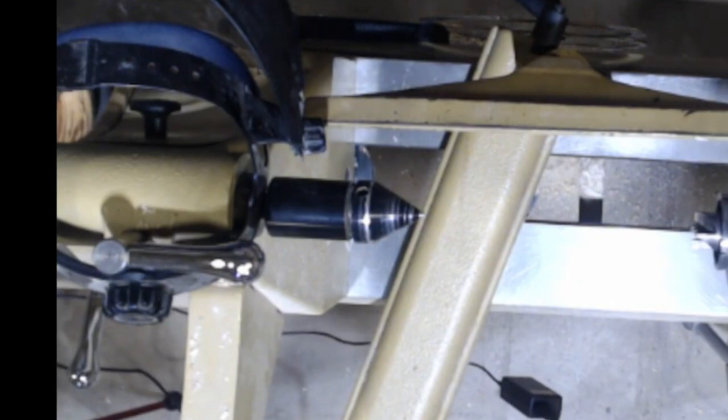I threw two or three of them off the lathe because no matter how hard I would squeeze this tip down, the bark is very hard and resisted, but it's not hanging on very hard. And so whenever I'm turning and trying to hog off some material, it came loose and started flying. So I was going to cut through that to keep that from happening.